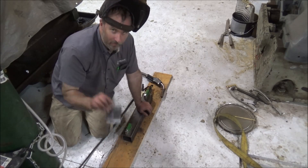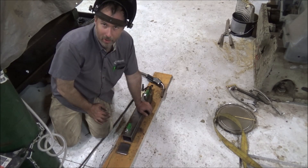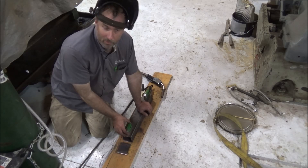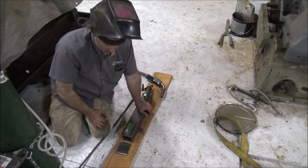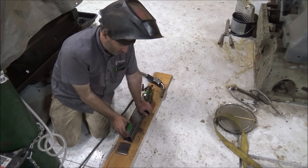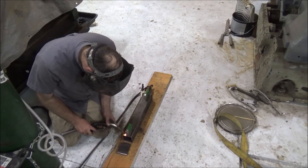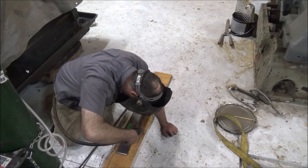It makes it a lot stronger by adding this plate on the end of the tube. My welder is dialed in — I pretty much never adjust it, I just leave it cranked up and spray arc. That's the way I weld with this Hobart welder. Seems to be working just fine. So I'll just eyeball this up — there's nothing super critical about it. I've cleaned the paint off and I'll just burn this in here.